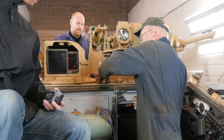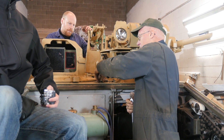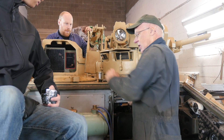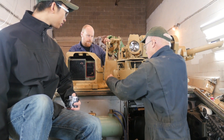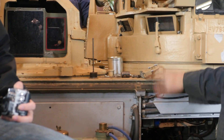I'll get this cap off here. There's also a hand pump which was a backup to the electric motor-driven pump. The hand pump does nothing — there's a pressure gauge in there and we're not generating any pressure. You can feel some pumping going on but no pressure. We've got a bone dry tank here, so the first thing to do is get some hydraulic oil in there.